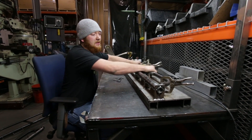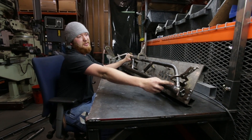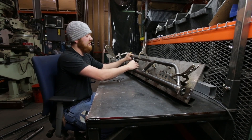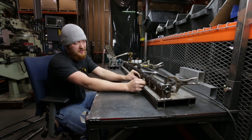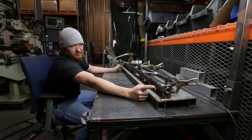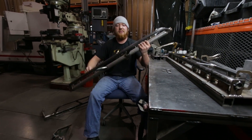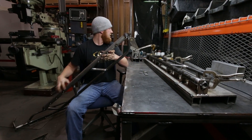This is the actual harness bar jig. You can see it places the main harness tube, then the support tube, and the little triangulation tubes inside, as well as placing these little harness minder straps for your harness to go through. You place all your tubes in there, weld them up, then take your clamps off and remove two bolts, and this is what you end up with — the center harness bar part.